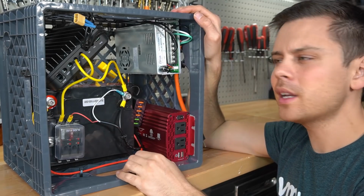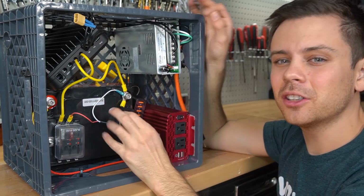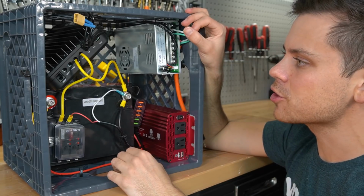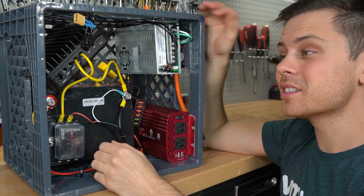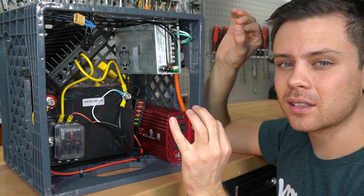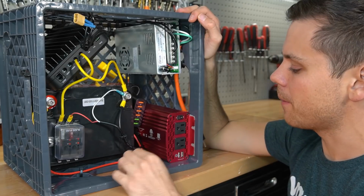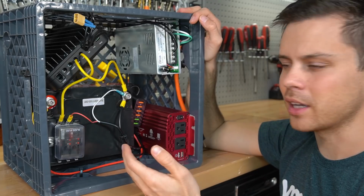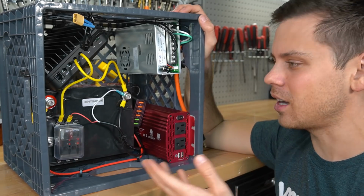Another thing I wanted to point out is people were talking about the screen of the MPPT, and personally I don't like to look at that. I would like to add a shunt to the system just to see state of charge and to ensure that I'm having max output with my solar panels, but if I have to check my system all the time, that means that it's badly designed. With this system, I want to keep it connected to solar panel power all the time, and I want to use it as an uninterruptible power supply. I want to run this inverter 24 hours a day, and if I calculate for a specified load, I want to be able to power it. If I have to check the stats of my system, that means that it's undersized.